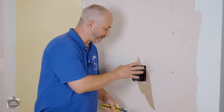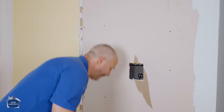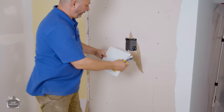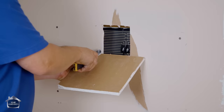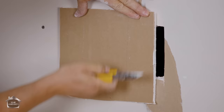If you've seen some of our other videos, you've probably seen this already, but this is such a great technique it's worth revisiting. This is called the California patch. What I'm doing is I'm just eyeballing to cut a piece of drywall a couple inches wider in both directions so that it'll cover my hole. I'm going to line it up, take my knife just inside the cut, and score the brown paper from the backside on both sides.